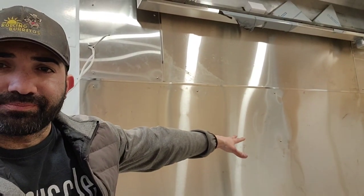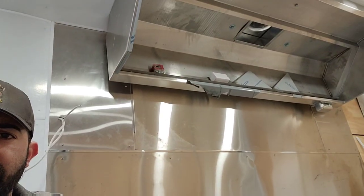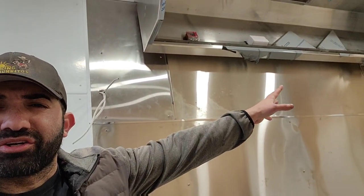Don't ask me where I got them because that price — about $60 to $70 a sheet — for 304 stainless steel mill finish, about 20 or 22 gauge, just doesn't exist anymore. Underneath the hood you want to use stainless steel because it gets super hot. FRP will probably melt once you turn on all your cooking equipment, and I don't even think they allow FRP underneath the hood. So always use stainless steel there.